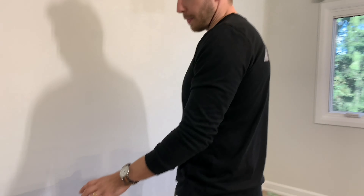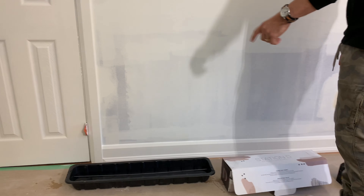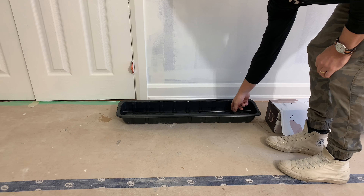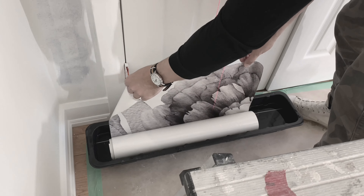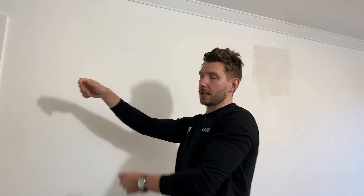This particular wallpaper is pre-pasted. When it's pre-pasted, what that means is you're not applying your own adhesive — it's got adhesive on it already, but that adhesive needs to be activated and it's activated by water. There are a couple of ways you can do this. The easiest one is to get one of these trays from the store. They've got a little pole in the middle, which helps because as you roll the wallpaper and sit it in the water, that pole keeps the roll submerged and pulls some of the water off as you pull it up, keeping things a little bit cleaner.